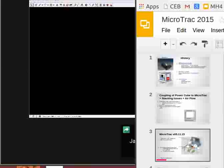You see the issue: if you have one roller chain just down the middle, you probably want what you have in your design with the track piece. Your connection is wide, like 2 inches wide or something. So we probably want this roller chain as two strands, at about 2 inches of separation or something like that, so that the track won't twist.